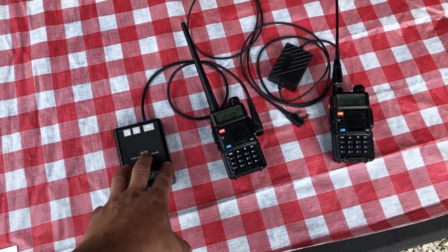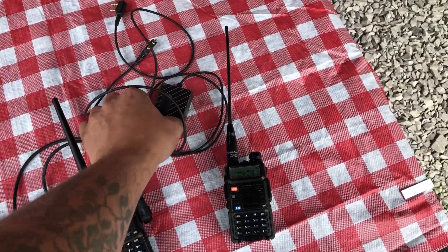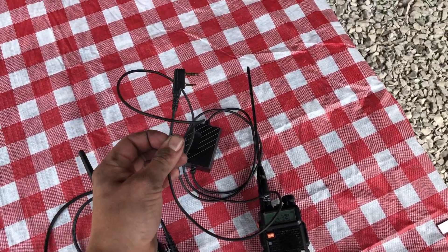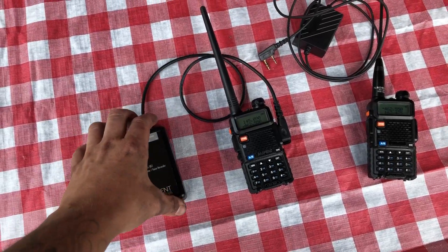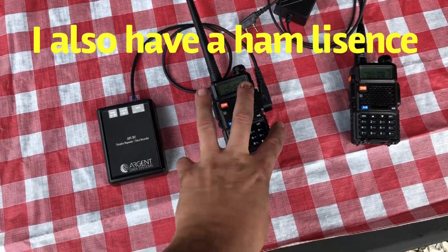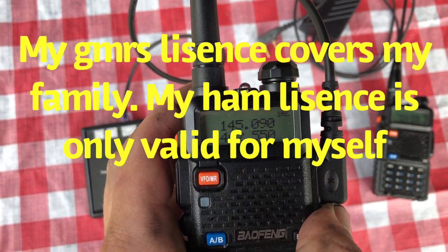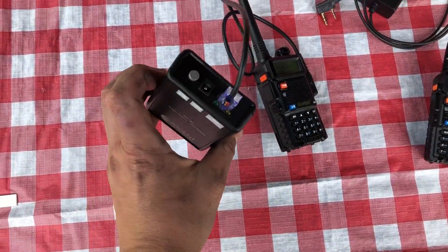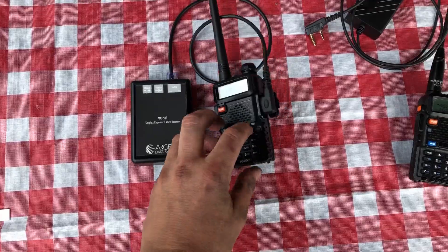What I've got going on here: I have a simplex repeater and I have a duplex repeater. This is out here just to show you what a duplex repeater looks like. This specifically works for Kenwoods or the Baofengs — that's the connection. You can get different adapters to work for different radios. It's currently set to a GMRS frequency, which I do have a license for, so I can transmit on GMRS frequencies. That's channel 15, 462.550. This takes batteries, or you can put auxiliary power on the side, which I'm going to do, and I'll show you about that here in a minute.